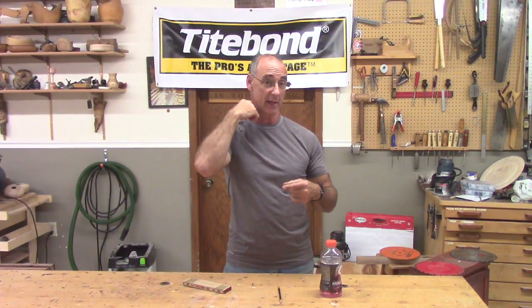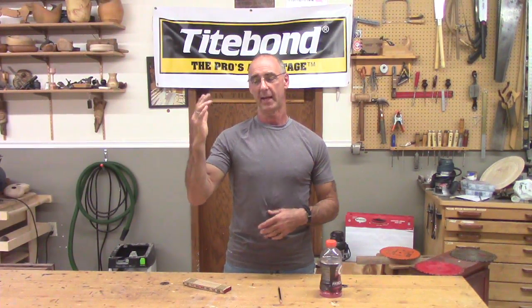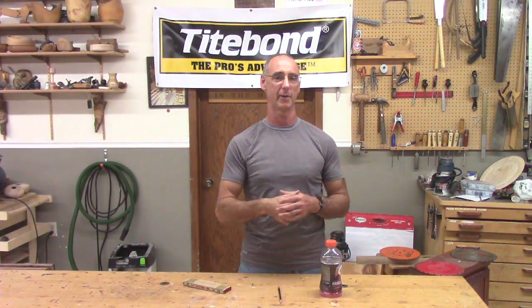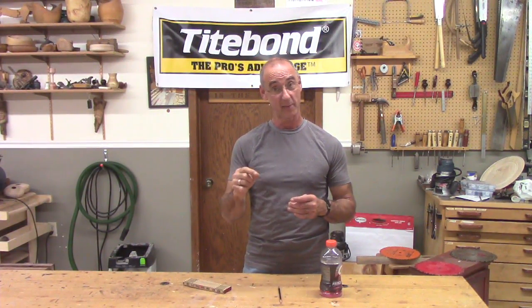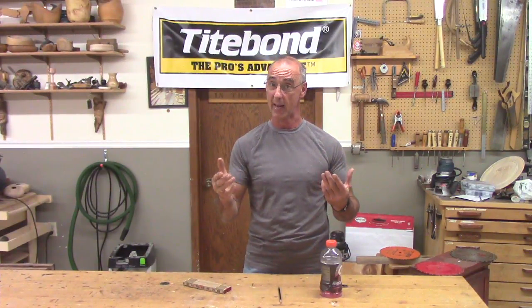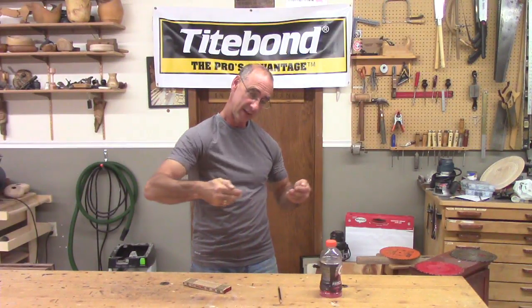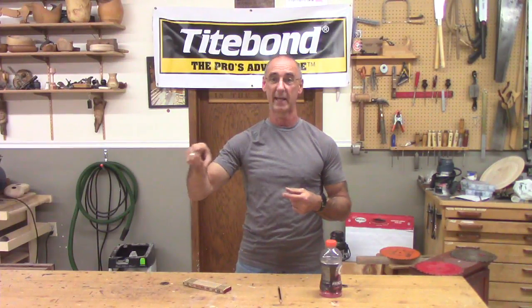And on something like an end grain cutting board, and here's the deal with this. You get a bunch of woodworkers in a room and they can argue about this for hours. Some 80-year-old woodworker is gonna stand here and say, I have put 200 end grain cutting boards through a planer and never had a problem. And what I'm saying is that if you have a problem, it's really, really bad. Because if the knives catch on the end grain and they have the opportunity to fracture the piece, chunks are going to come out of the infeed side like missiles and go screaming across your shop.